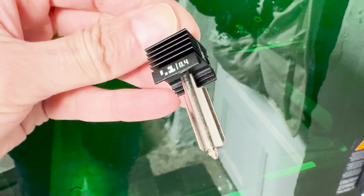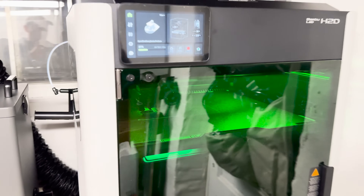They've also carried over from other printers a much quicker nozzle change system. From 0.2 all the way up to 0.8mm in diameter, you can swap nozzles quickly through a menu system — just clip the new nozzle in, put the silicone cover over it, and you're done in minutes. One final note: the nozzles are hardened steel now. No more brass, so any abrasive filaments with carbon fiber infused in them won't be a problem for these nozzles either.